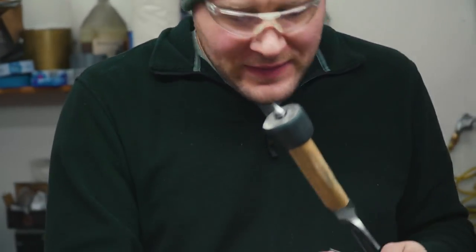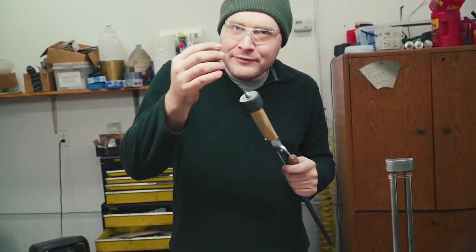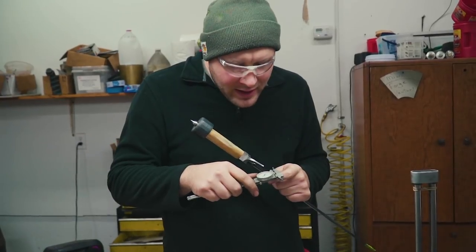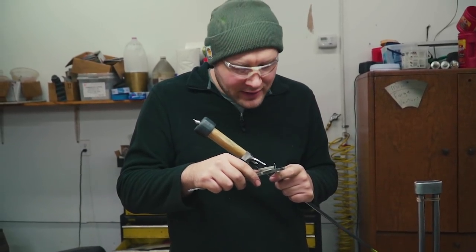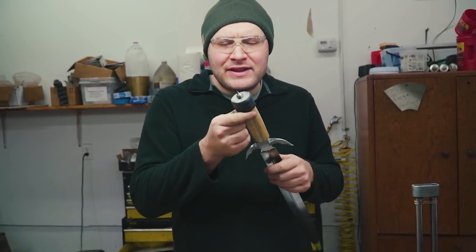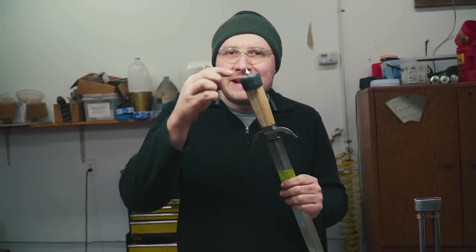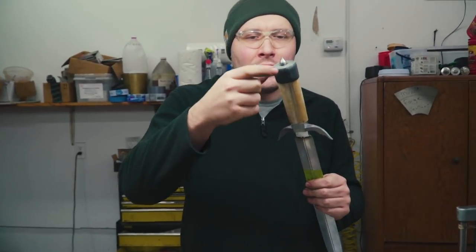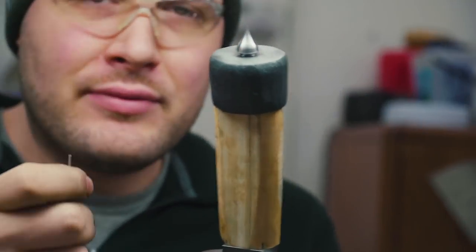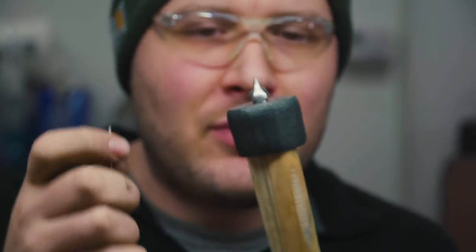And so if you guys want to do this, this drill bit that I'm using for a takedown tool, it's about 85 thousandths thick. On smaller knives, I use a 16th inch drill bit as my takedown tool. But on the bigger ones, I like to use a little bit larger drill bit with a little larger hole in the pommel nut. That way I can really torque it down. Since this is a really big project, I wanted to go ahead and use the larger size hole.